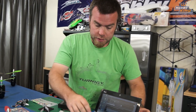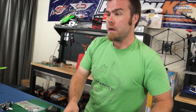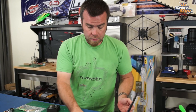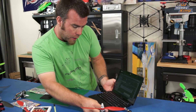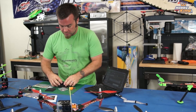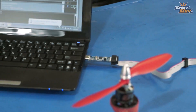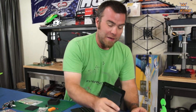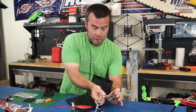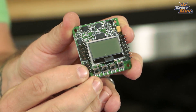If you click the little magic green button, that will update the firmware across the connector, so I'm going to plug this in and run that. The board plugs in and it will locate and install the device driver in Windows. If that does not happen, the device driver is available on the HobbyKing site. Now, this thing — you can plug it in backwards. It is these six pins right here on the board, just next to the buttons and LCD — that's where you connect the six pins on the end of your programmer.